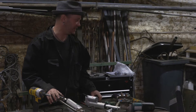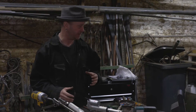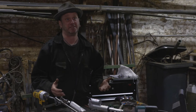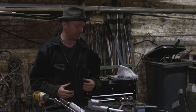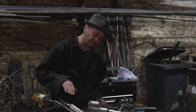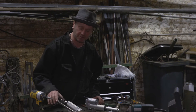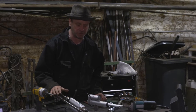This is stage one — the armature stage where you build the main frame, basically the robot skeleton. This involves making it sturdy but lightweight and putting in these motors which are called linear actuators. They're all 12 volt, which keeps it nice and safe, and they're nice and quiet and do a smooth job.